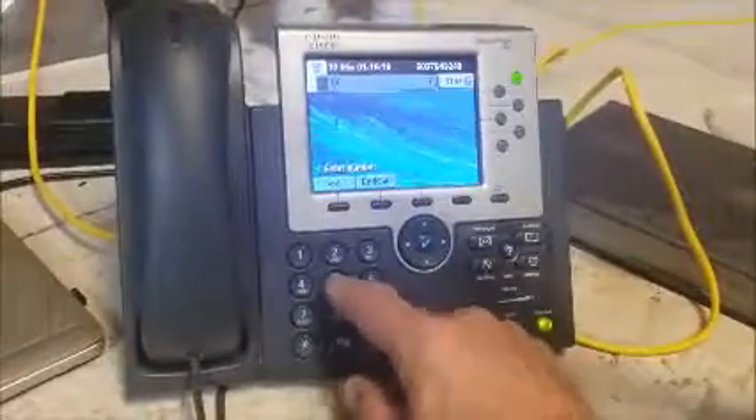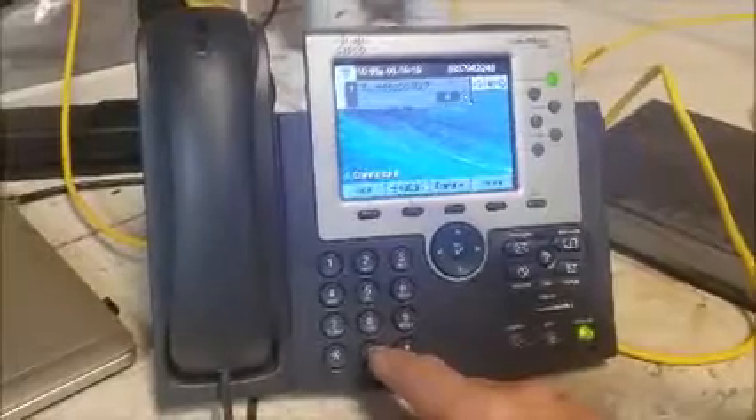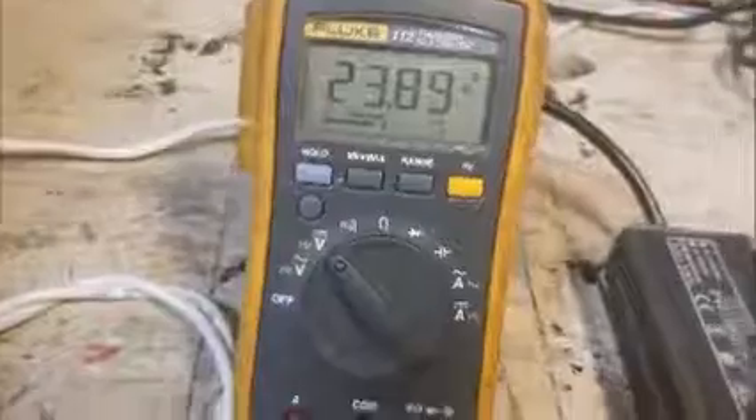That was just one zone. I'm going to dial our number again. With the Bogan system, if you hit 00, it's all zones — so we'll come over here and watch the relay. All the lights come on — it's like Christmas! And again we have 24 volts at the speaker. I've got a mute so I don't have feedback, but the speaker is getting powered. We can talk and that's basically how we solved it.